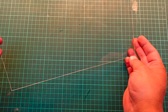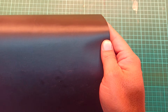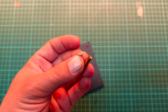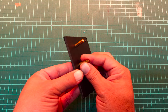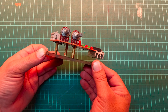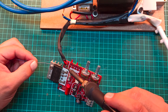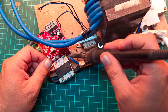To mount the control board, I am using an acrylic sheet of suitable thickness. This makes assembly and disassembly easy whenever maintenance is required. Drill holes in the acrylic sheet and mount the circuit board using PCB spacers. Attach a heat sink to the triac to improve heat dissipation. Now solder the main transformer input wire and the 220 volt AC input wires to the spot welder control board as shown.